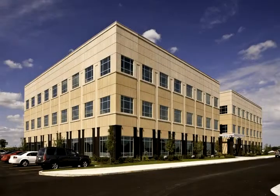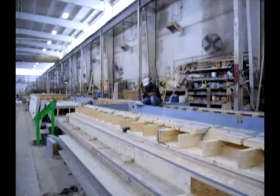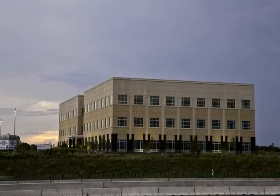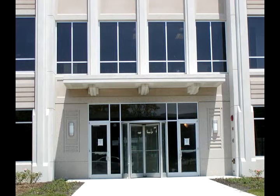The next step is whether the building is big enough to get some duplication and reuses on the molds. The site matters too — if it's in the middle of the suburbs where you've got full access all the way around it, you can do about anything. But if you get some buildings that are tucked away on a narrow city lot with no access on the sides and maybe only street access, it just may not be a candidate for the equipment to erect it.